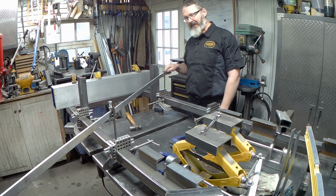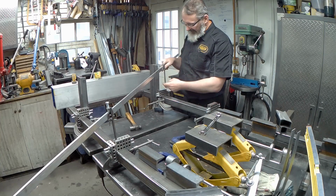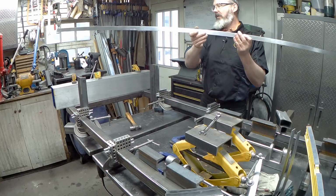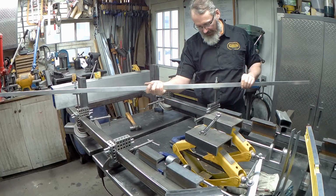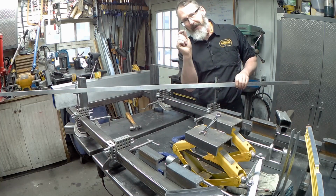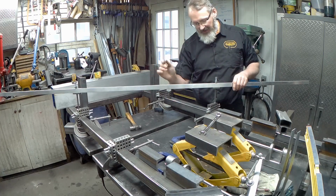Hey, so check that. Again, when you're using this, not that I'm an expert or anything on it, but what I'm trying to do is gauge the feel. So the tips have been ground to a point, and I'm just gauging the feel. It just goes straight into the hole without a concern in the world. It drops right into the tapered hole. So I set that in the same hole over here, falls into the hole exactly the same way. If you get it off just a hint, you get a little feel of it pulling. Again, a lot of this sort of measurement stuff when you're down into the weeds at this level, it's about feel. So that's a feel thing, right?